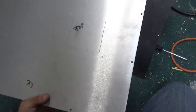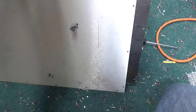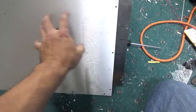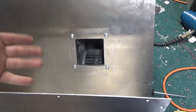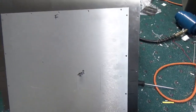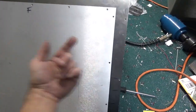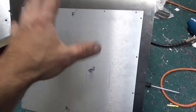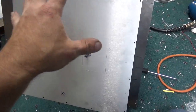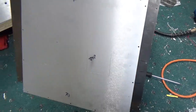This is the bottom cover for the RF deck. I made sure it was perfectly square and traced it — I'll cut a hole there and have the gasket material between the two. I'm going to have a right-angle piece of aluminum affixed to each side of the RF deck with a stud coming up on each side, so when he places the RF deck down, it'll line up perfectly and you can put a nut on each side — it'll hold it in place nice and snug so no air will escape.